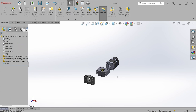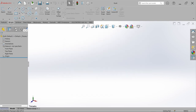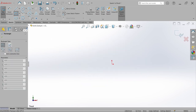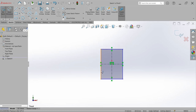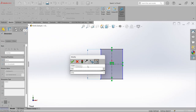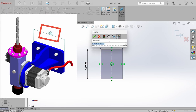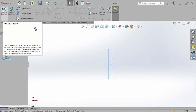Now we have to roughly design a base plate to locate these components. Go to New Part, hit OK, go to Sketch, select the sketch and select the front plane. Go to the rectangle tool, select the center rectangle tool, and start from the origin. Go to Smart Dimension and set the length. Our ball screw length is 1300 mm, so take it 1300 mm plus 100 mm for the motor mounting space. For the width, our drilling system width is 280 mm, so let's roughly take it to 300 mm. We will adjust it later. Close the sketch and go to Extrude Boss.